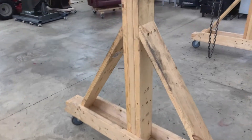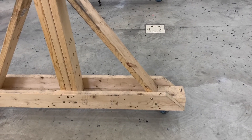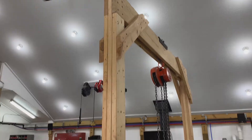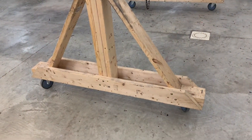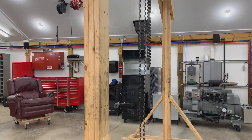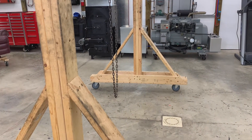These diagonal supports come up about 3 feet and go out approximately 2 feet. The overall dimension of this is 9 feet tall from the concrete to the top of the beam, and the bases are 5 feet wide. That arrangement has worked out well — the weight is centered in the middle, so the 9-foot-tall by 5-foot-wide configuration has been very stable for all the projects I've done.